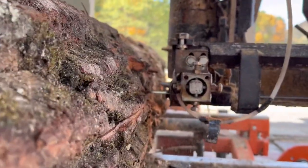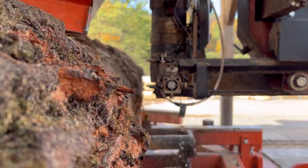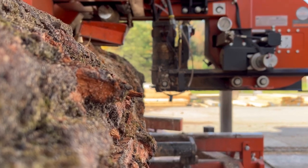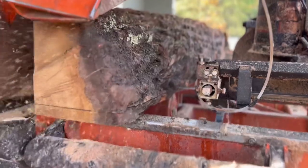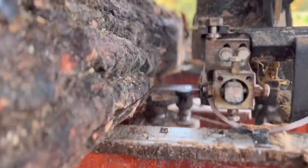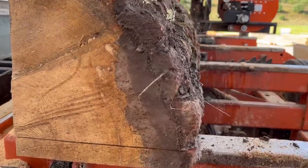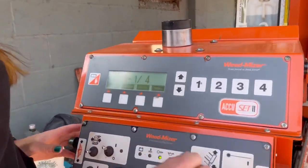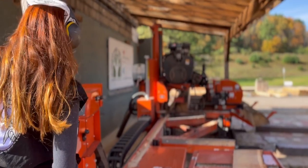So what is quarter sawn lumber used for? Well, it is mainly used for cabinets, flooring, and high-end furniture. When quarter sawn, the wood is less prone to expand and contract, which makes it more stable all around. Not to mention, it wears a lot more evenly. And because of its strength, it has been known to stand the test of time a lot better than plain sawn wood. This would be why it's great for flooring.